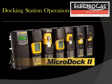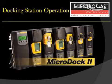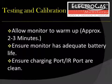The BW docking station can be used to bump test and calibrate your monitor. We will cover those functions now. Before you begin, it is very important to allow your monitor to warm up for 2 to 3 minutes. Ensure that your battery is adequately charged and that your charging or IR port is clean.